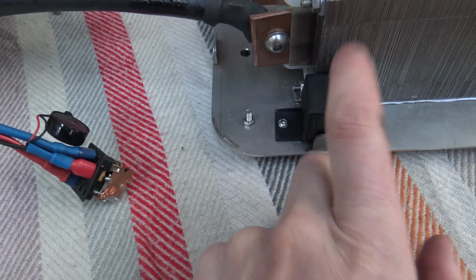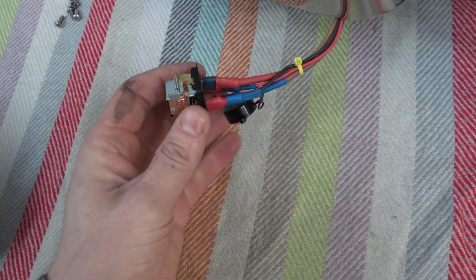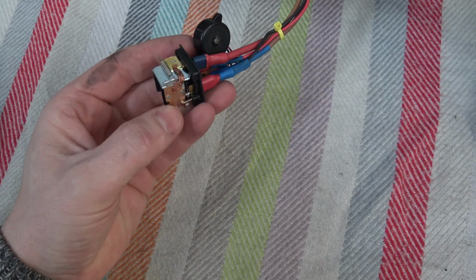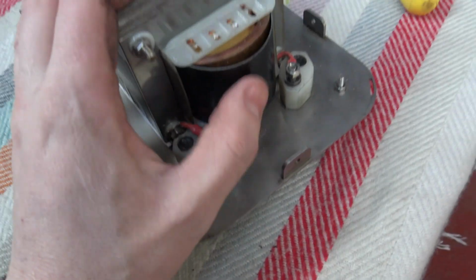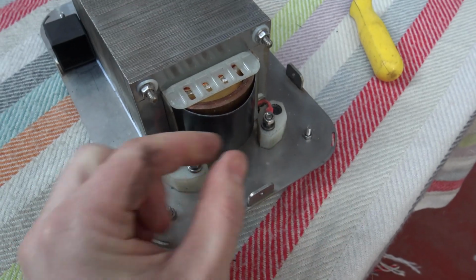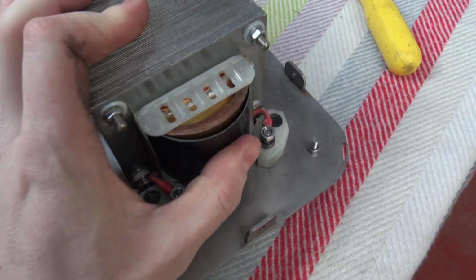And this here is just to hold this relay, obviously. But it's the handiest way to take it off and on. You just clip it on and off. This really looks damaged, but it's not. If anybody ever pulls the cover off, I usually think you destroyed it, but this just slides straight back in. This bit of plastic nylon board here protects all the other extra components, such as a switch, when I put the cover back in, from hitting the secondary winding and shorting out against it.